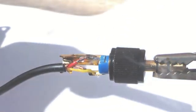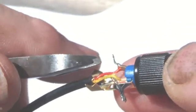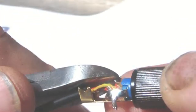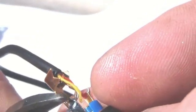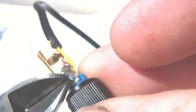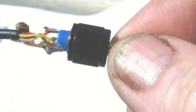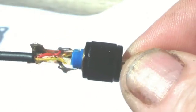The next step is to remove the excess wire sticking out from the solder joints. Starting with the red wire, a pair of small diagonal cutters is used — nail clippers work equally well or better. The wires are carefully trimmed away so that the clear plastic sleeve and the metal body of the jack can be fitted down over this assembly.